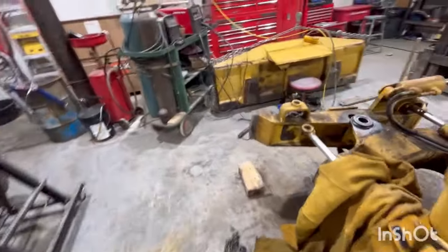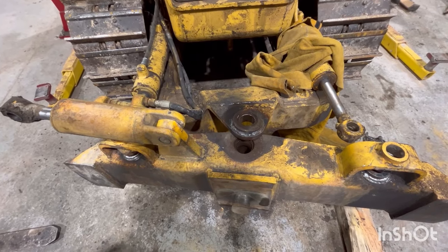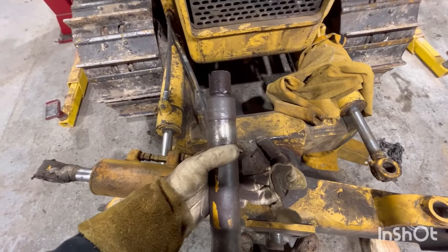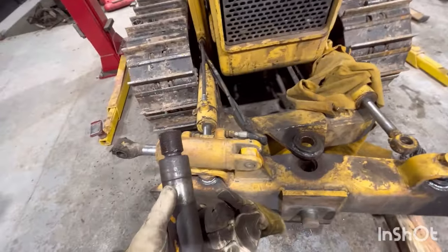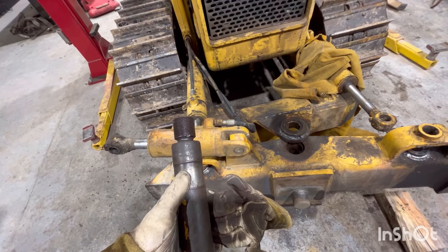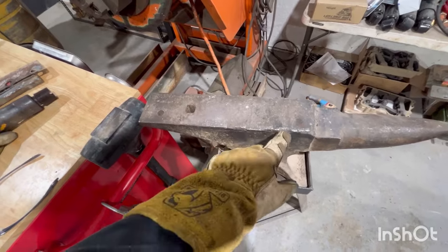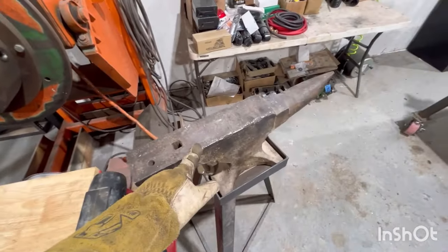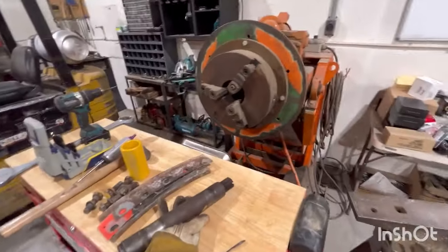Like I said in a prior video, I think usually you want the bushings to be harder than the pins, so it wears the pins out and then you would just put a new pin in. I could do a hardness test on the bushings and figure out how hard they are, then build a pin to accommodate that. But wire out of a MIG welder usually ends up around 40 to 50 Rockwell. I might just be talking out my butt, but it seemed like I'd looked into that. I was also thinking about cleaning up my anvil top and remachining it, but you could almost ruin an anvil doing that if you don't know what you're doing, so I just left it alone.